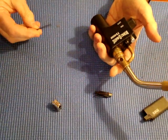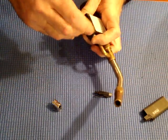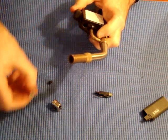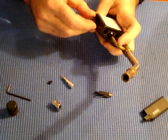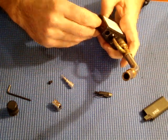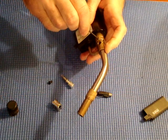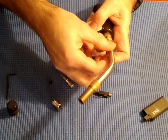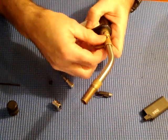Now to take apart your TS-4000, hold on to the silver trigger, get an Allen wrench, and loosen this — you don't have to remove it all the way. There's a spring here. Slide this down in a downward direction because there's a wire. Use an Allen key here also. Loosen this off — this comes off. And there's also a spring here.